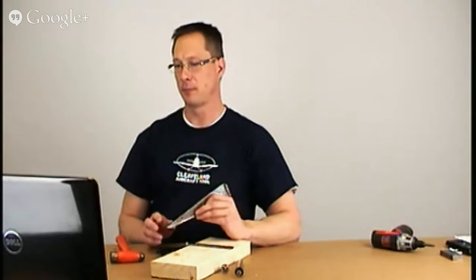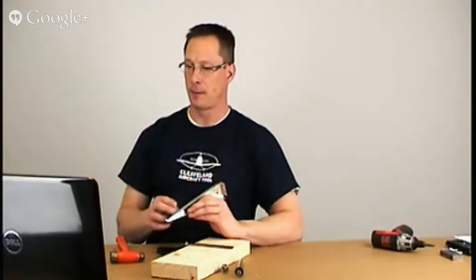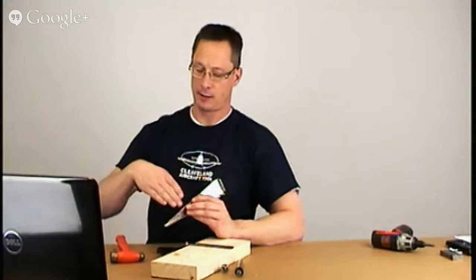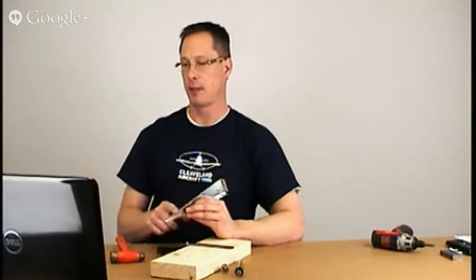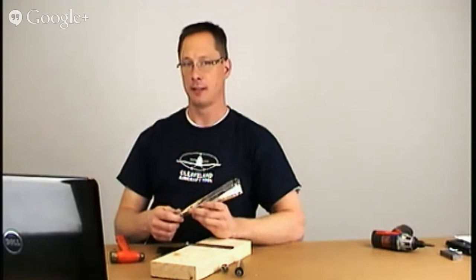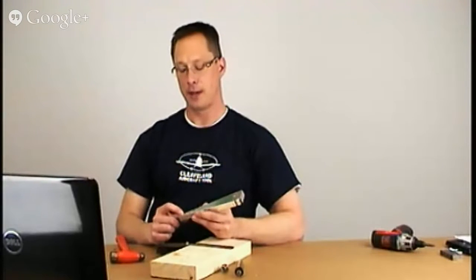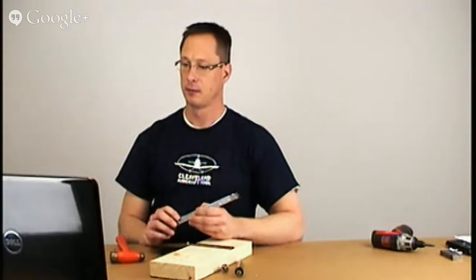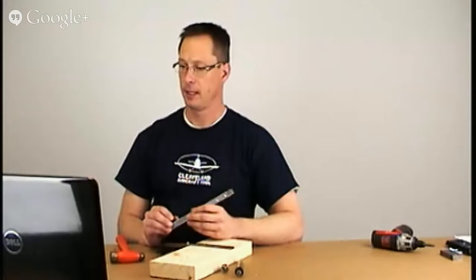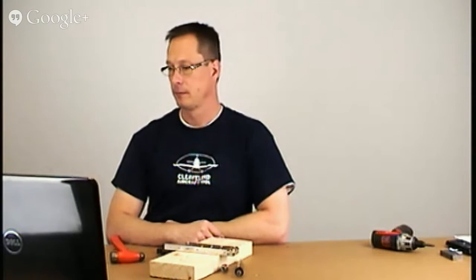Generally, as we discussed — Bill's my brother-in-law — when I was out helping him on his RV project, we used a square to check the rib flanges and make sure everything's 90 degrees. If a flange isn't 90 degrees, the skin conforms to it when you rivet it down. When you open that flange up, you're forced to figure out how to get it back to 90 degrees, and you also stretch the web a little, so the holes may not even line up with the skin anymore.